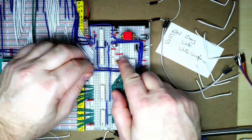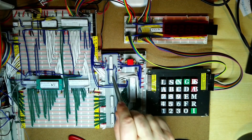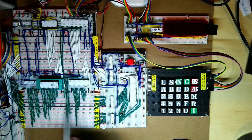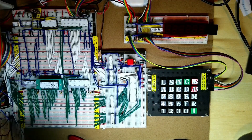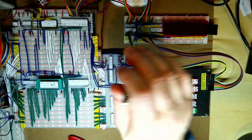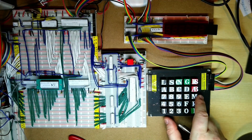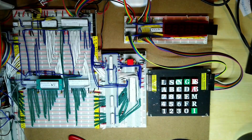Hooking in the read-write and E signals and then the new Q signal, connecting those into the bus signals. Hooking in the interrupt lines - non-maskable and interrupt lines - then all of the data lines. I've finished wiring everything up, gotten rid of the jumper leads. The board is shuffled around with still a few fly leads going to the VGA card. I've made the cables a bit longer so the display can be moved around, and the keypad cables were a bit short and interfering with part of the board. It looks a lot neater and should be more reliable - the board is in good shape to move on and sort out the ribbon cables on the VGA card.